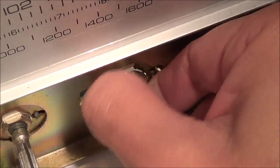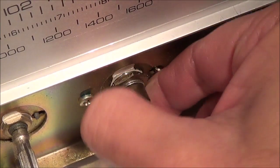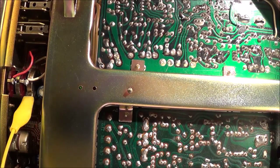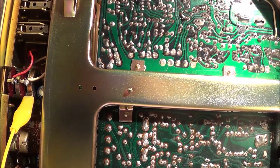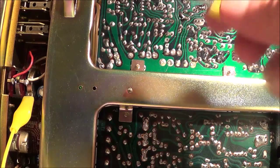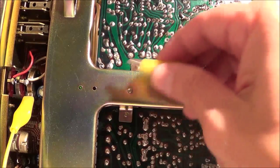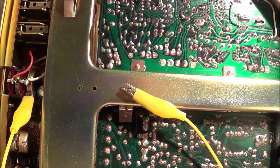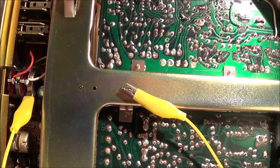I have a feeling I've at least taken care of the hum problem. I'm touching it right now — you can hear the hum big time. So I took an alligator clip, attached it to the housing of the volume control, and got a good ground with the other hand. Now when I touch the volume control — no more sound whatsoever.